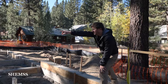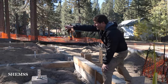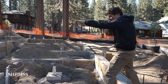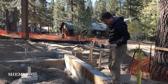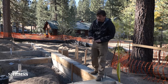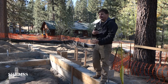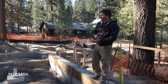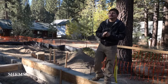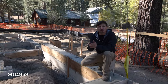So the back of the corner, left corner, back of the house, this is my elevation. This is the highest point exactly. And we gotta bring it from this point all the way to here. So here it's gonna be pony walls. We have the video in the class. We gotta do pony walls. It's a little bit cheaper. The labor, yes, it takes a little bit more time. For my crew, I can say 4 hours, we can make those pony walls. But it saves a lot of money. We are saving pretty much on the concrete.